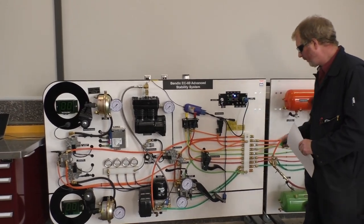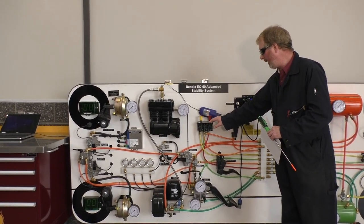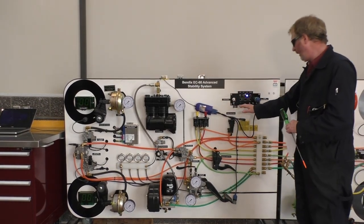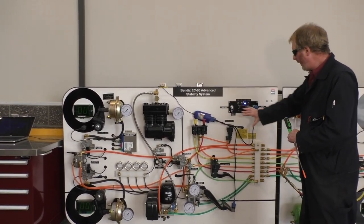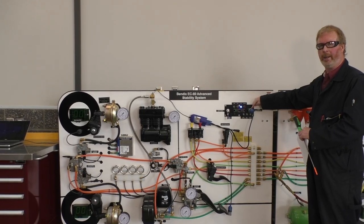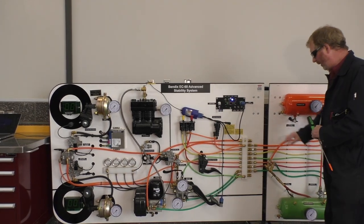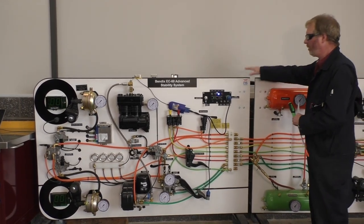This section in here, this is what would be in our cab. So my yellow and green buttons, you're familiar with them. That's my parking brakes, red for the trailer, which we'll get to shortly, yellow for my tractor unit, my accelerator, my brake, and what we call the Johnson valve, which is typically on our steering column. This section right here, we'll come back to this. This is my diagnostic port. All right, so that's where I'm going to hook up my COM adapter, my communication adapter, and we're using the Noregon universal adapter. Goes back to a laptop. We'll get to him later. This you obviously won't find in the real world. This is our manifold, which is basically connecting these two boards together.